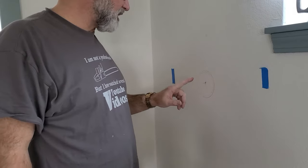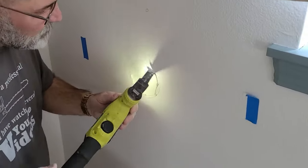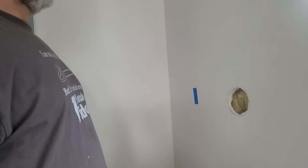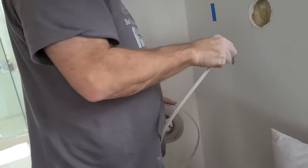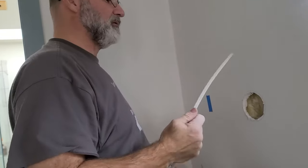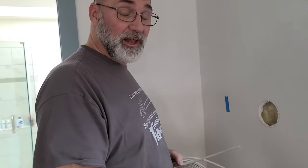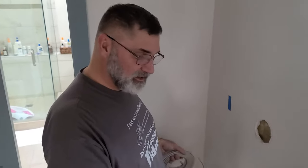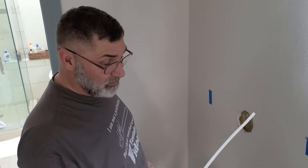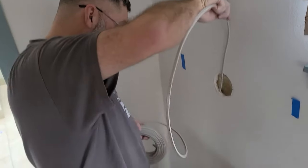Got the hole out for the light box. You can use a keyhole saw, you can use a razor blade — I like a multi-tool. Hopefully I'm going to get lucky and stick this Romex down this hole and it's going to pop out where I can reach it, down to that lower hole we just opened up. So this is 14-2 Romex. It's good for outlets in houses, lighting and stuff like that where it's low demand. If you were going to be in a kitchen with appliances or a garage, you'd want to use 12-2, which is 20 amps and higher. This is only 15-amp service, so this should be more than adequate. And this stuff is not cheap anymore, so getting away with a lower grade wire for this project will save cost as well.